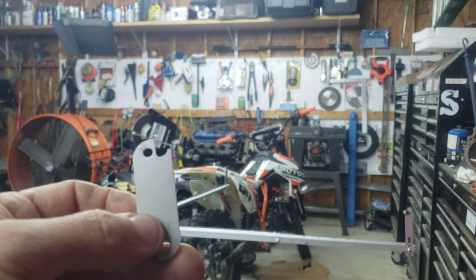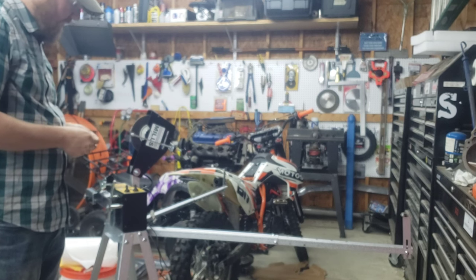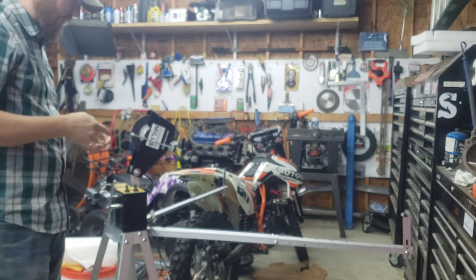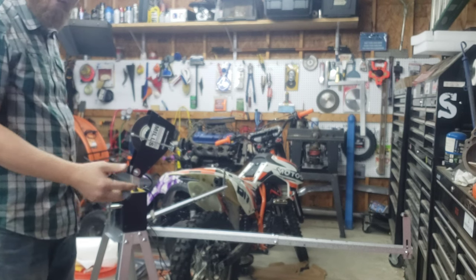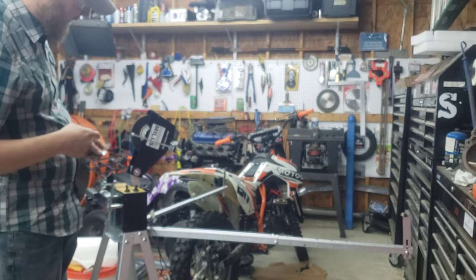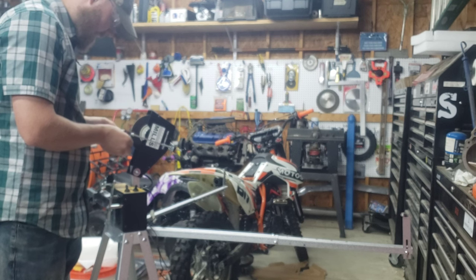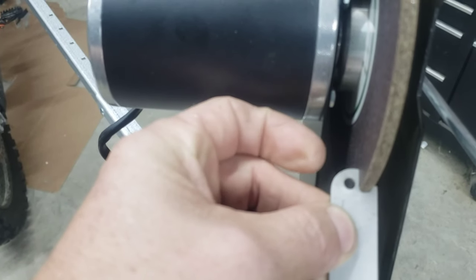You've got a profiler — it is meant to give you the shape that you need for the stone. Here's the stone they give you to do it with. Whatever safety you feel like you need, put it on. The only reason I'm not wearing gloves is because if it were to grab a glove it can suck you into it, so hold it lightly. Nice and smooth — oh, for the first turn-on that is nice, oh that's quiet. Let me put my glasses on. I literally don't think you get much better than that — I'm turning anywhere I want and the profile is good.